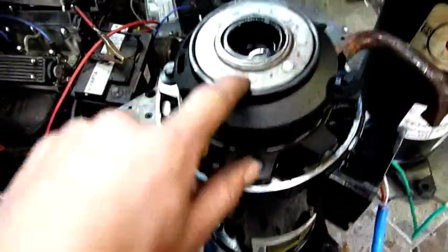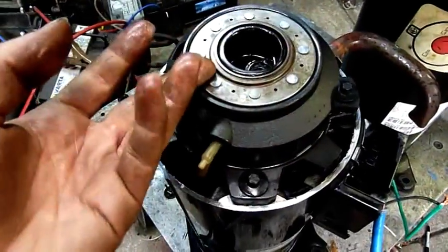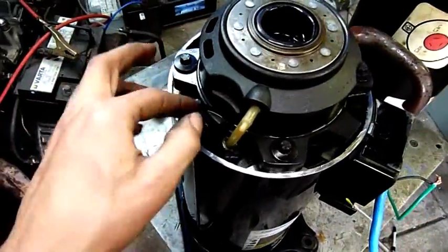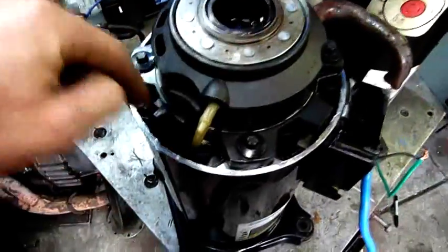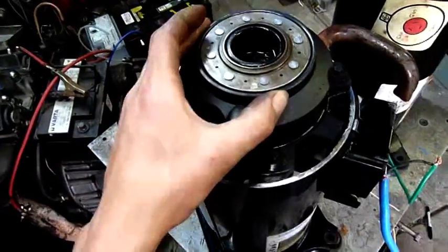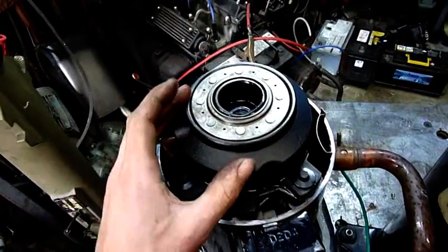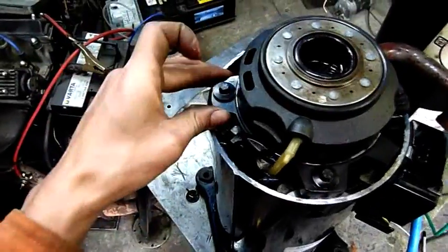You've got pressure underneath this seal pushing up on the lid and pushing this part down. When it's at zero pressure starting out, it can rev up, build up pressure, push this up, push this down, and go into full load mode — rather than trying to start at full load. So it's got two functions: one, the compressor doesn't wear out, it wears in; and two, it allows it to start a little easier, softer, with less current draw.